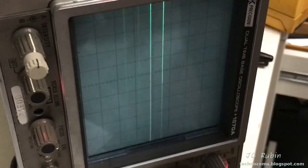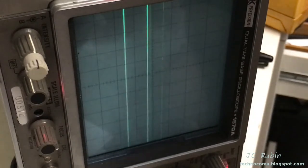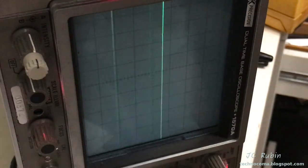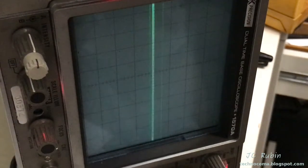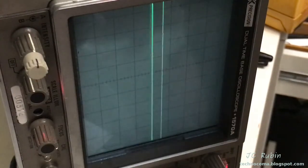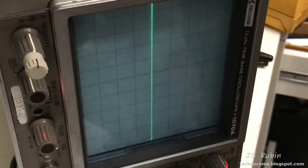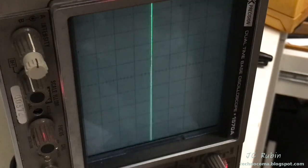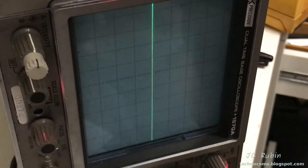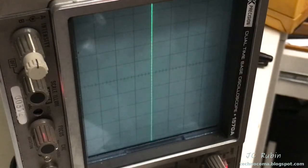It should come as no surprise — this oscilloscope just barely being a four-channel oscilloscope, if only by definition. The flicker you're seeing on camera is the same flicker I'm seeing looking directly at the oscilloscope. What I'm trying to do is take these four traces in quad mode and get them right over to the center graticule so it looks like one trace — that's part of the setup procedure. I'll fine-tweak this off camera and get it just where I want it.